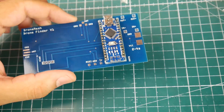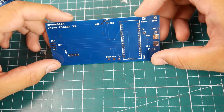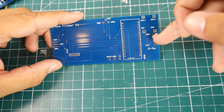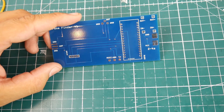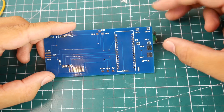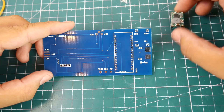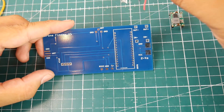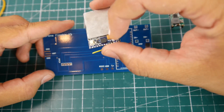Let's grab another board. I have this Arduino here — it was a pain to put in because I had solder still on the pins. Here we have our battery terminals where your XT60 would be connected. It'll route to this voltage regulator right here — I'll leave a link to everything down below. So it goes to this generic voltage regulator, then you have your Arduino Nano, and then your SkyZone VTX receiver. I'll post a link down below — make sure you get the same one because you can choose the channels from it.